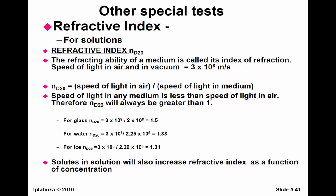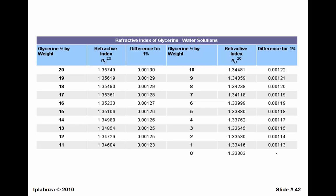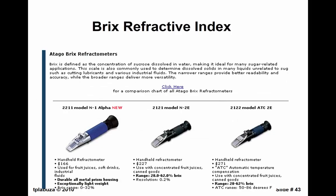If you put solutes into the solution, that will change the refractive index. They've made instruments that fit different categories — one for sugar solution, one for maple syrup, things like that. Here, for example, is glycerol, glycerin, the weight percentage going from zero up to 20. As you see, they actually do it by five decimal places — 1.33303. It goes from 1.33 to 1.357. Not a very big change over 20%, and that's one of the problems — you have to be very careful.